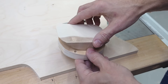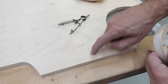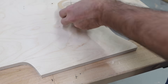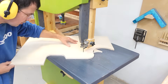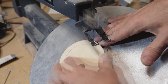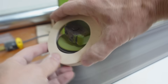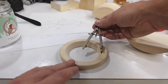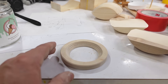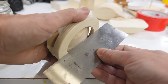This is the base I made so far — it fits nicely — but it doesn't need to be quite as thick, so I'm going to use this Baltic birch, which is also much nicer since this is going to be a gift. The inside of this circle is 38 millimeters in radius and 12 millimeters thick, which is just deep enough that the camera doesn't hit by a few millimeters.